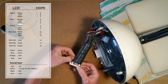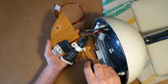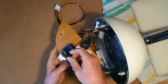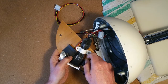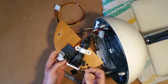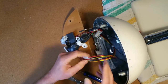Be aware the pin outs available on various websites are incorrect. TMDS VCC is 3.3 volts, not 5 volts for the 15 inch screen, and the pin outs shown here are correct. I used a four pin Molex socket and power the screen from an old ATX power supply. I also used the motherboard as a template to mark and cut out a thin plywood baseboard to mount the Molex and the HDMI sockets securely inside the G4.